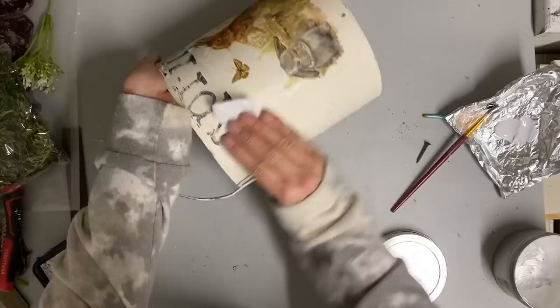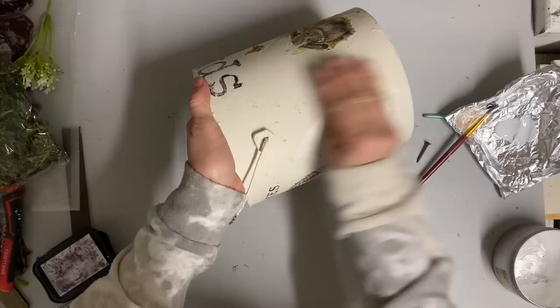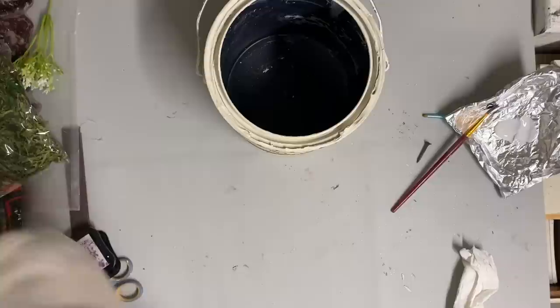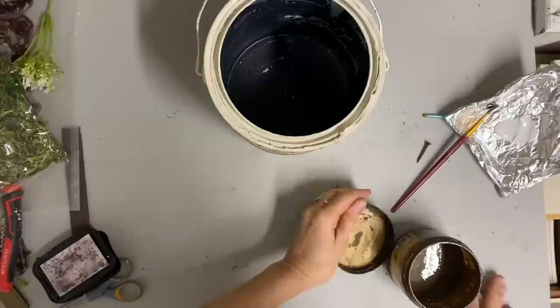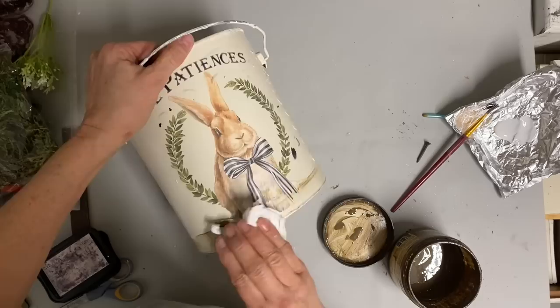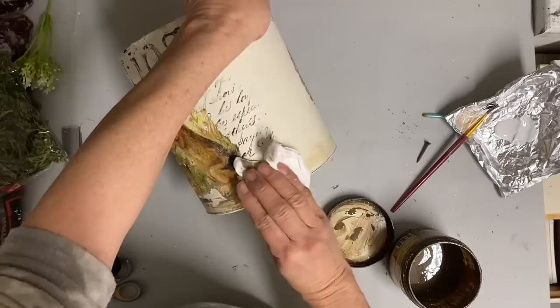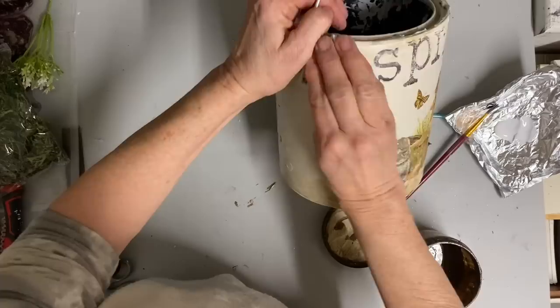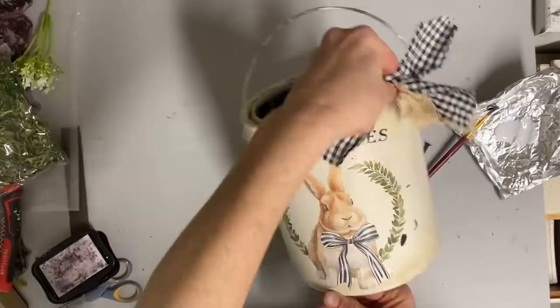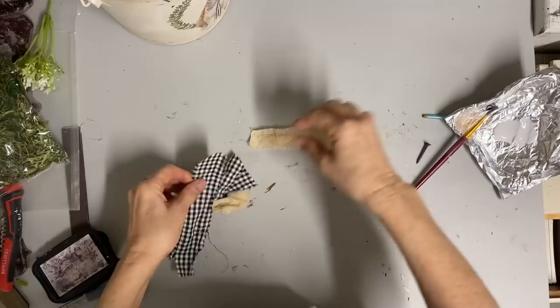I wanted to antique this one up but I didn't want it to grab too dark, especially since I decoupaged with the napkin. Once it dried well, I went over it all with a clear wax and coated it really well before doing my glaze - I just didn't want it to take too dark, and I knew clear wax would keep that from happening. Anytime you're going to add a brown wax or antiquing glaze, try the clear wax first because it gives you a lot more control and if you get too much it wipes away much easier. I want to concentrate more antiquing around the top and bottom.